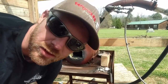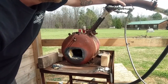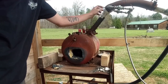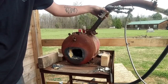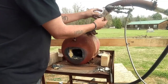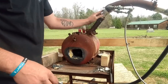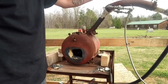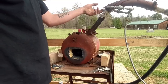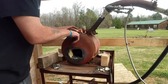Kind of get up close to my forge as well. You can see the burner setup here. I piped it in where it comes through. I've got an exhaust muffler, hard pipe, flex pipe. This is open here. This is high heat tape to keep it together, because once you cut that, it wants to come apart. You've got to keep it together with a hose clamp clamped around the flare. MIG tips in there, shutoff valves, so it doesn't take all the air from the back. You might even have a couple of holes drilled here for relief to get the right fuel and air mixture. So a lot of the air comes out here, and it also blows this heat away. So anyways, let's get this opened up.